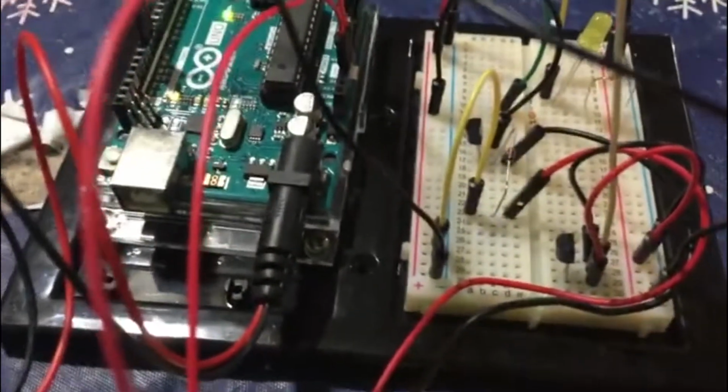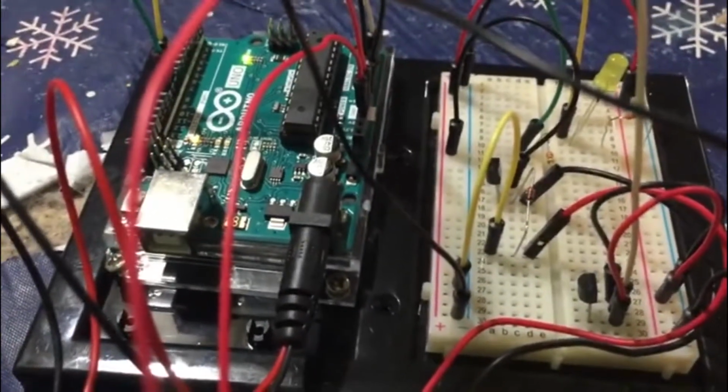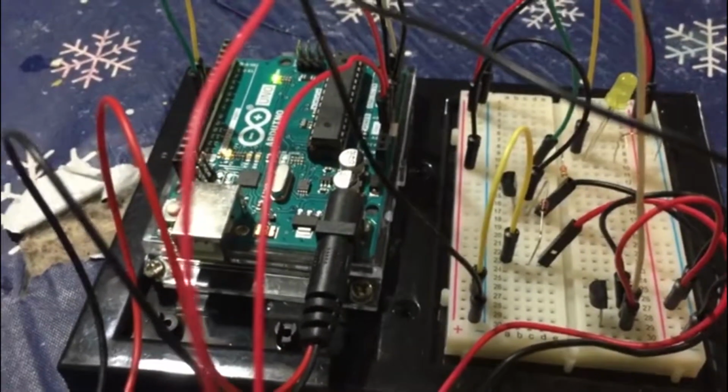It's outside the firebox. So it's kind of just a more elaborate system of what I have. You have sensors that if this sensor gives the right input, then this will happen. Most of the sensors are for safety precautions. Your brain says, all right, I've turned on the switch and I've turned on the gas. What if it didn't ignite and just had natural gas blasting into the firebox? Oh, that would be bad. That's why you have sensors to check to make sure that, yes, in fact, Virginia, we do have a fire.